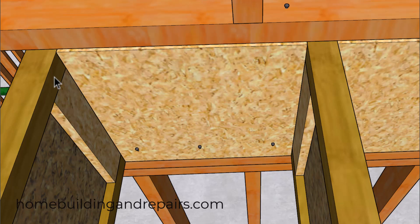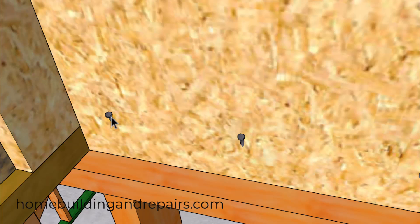This tells me we don't need to get too carried away with nailing the blocking into the top flange, where nails could actually split it. The floor sheathing and bottom plate wall framing nailing will help connect everything together. I did find something suggesting you might need to use three nails in this area, or have them spaced 6 inches on center.